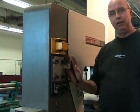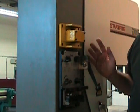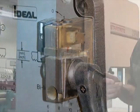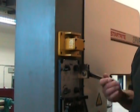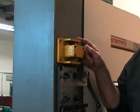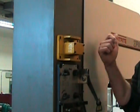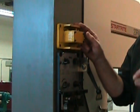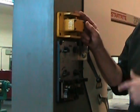So we have our bandsaw blade welding attachment that includes everything we need for welding bandsaw blades. Let's start by looking at this apparatus. It's a small shear for cutting the blade. The surfaces to be welded have to be flat and parallel. If you don't have this apparatus, you can use a pair of snips and clean up the edges on the pedestal grinder. We also have a small grinder to clean the sides and the back of the blade's body. Since this blade has to pass through the guides of the bandsaw, we'll have to remove any bumps or irregularities on the surface that were caused by the welding process. If not cleaned up, the blade will jam in those guides.